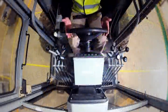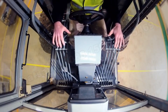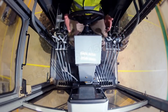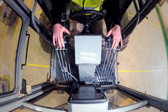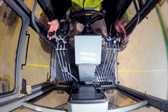The console has a foot pedal which allows it to move forward toward the operator for a more convenient position. The levers are in an industry standard layout, very similar to international brands such as Caterpillar. The levers are spaced close together with very short throws and very little effort required to move them, which is important to reduce operator fatigue throughout the day.